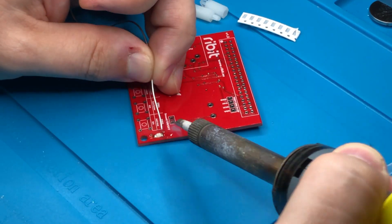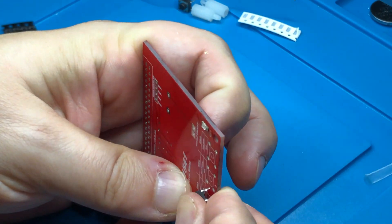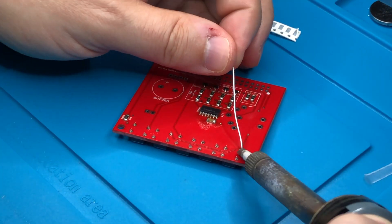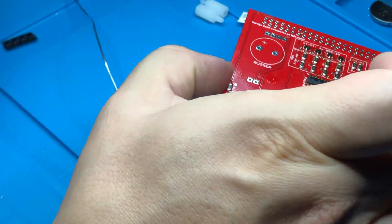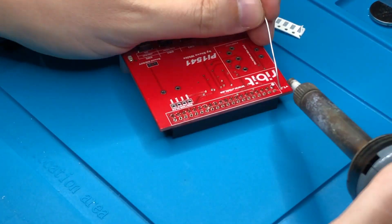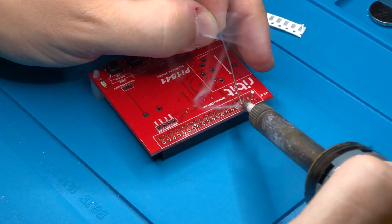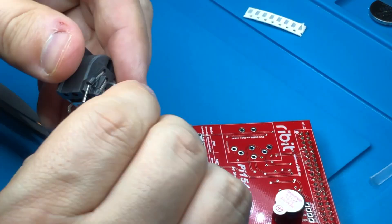Those transistors are tiny. This LED here is also sensitive to heat, so I should be a bit careful with that one. The buttons and the display are really optional, but they do make it a lot easier to control the Pi 1541 so you don't have to use a file browser application or connect a screen or keyboard to the Raspberry Pi. The buzzer is also optional, along with the jumper that enables it, but it's quite difficult to tweak the sound into something acceptable.